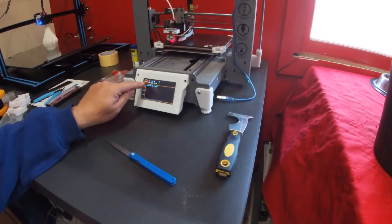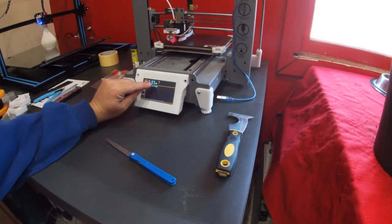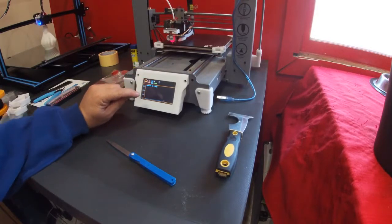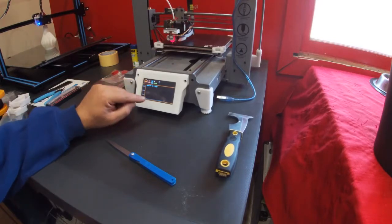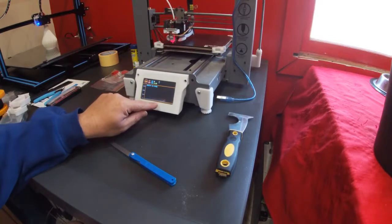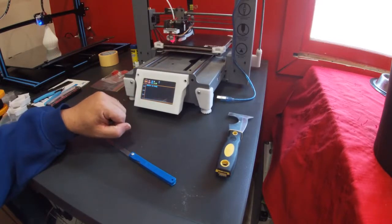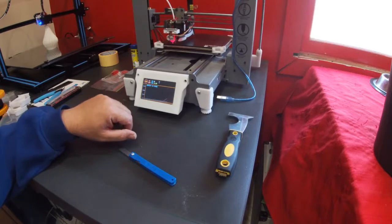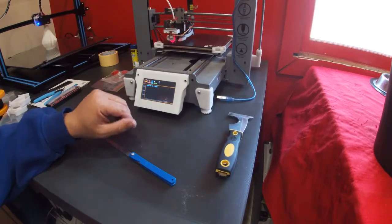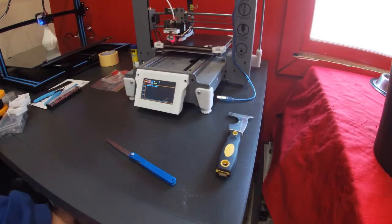And you can see here that it's actually got the temperature set at the bottom and the current temperature at the top. So the bed's set at 50, currently it's 19 and climbing. There's this nice little graph down here that is showing us the temperature. Blue is the bed and the pinky colour is the nozzle temperature. When we get up close to somewhere near where we want to be, we will go through and do our calibration.